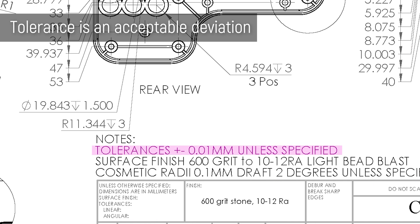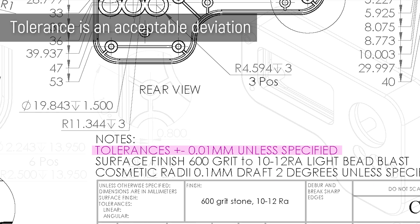Before I proceed I need to clarify the difference between tolerance and clearance because a few people got a little bit upset in my previous videos. Tolerance is not a single number — it's a range in which a measurement is acceptable; you have a minimum and a maximum. However, clearance is a distance you specifically design at the 3D modeling stage and it's a set number. This gauge tested both because it has a clearance, but also tests tolerance — you can figure out what clearance works in your software and what tolerances to expect when you print the file on your 3D printer.